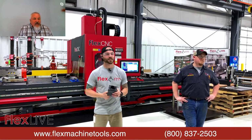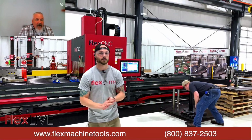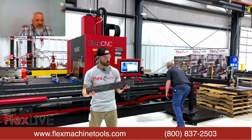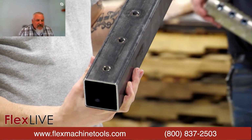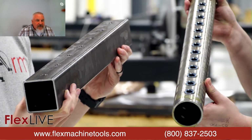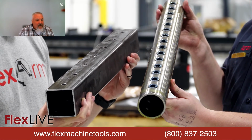Well, the geometry of cutting the collar, what we're going to do is we remove all that upflow material. So we put a 5-degree cutting angle on all of our flow drill bits that have that formation that removes the upflow material. And if that's the example there, Eddie, of the flush style, you see it's a nice clean surface there. What that's made to do is for connecting other parts where you've got surface to surface finish. The strength is virtually the same. You don't lose any strength between the flat style to the standard in most cases.